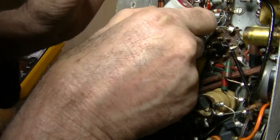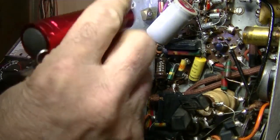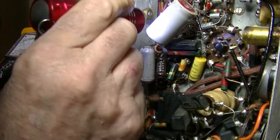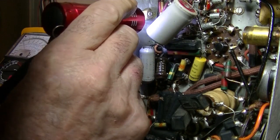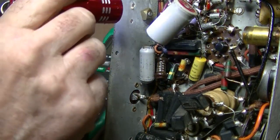to the cathode. And it's going to be a bit hard to show you, but I'll just explain this as I go along. The HT lines are both maroon in colour, and they're going to pins, not 3 and 5, but they're going to pins 1, 2, 3, 4 and 6, and those pins aren't used in the circuit at all.